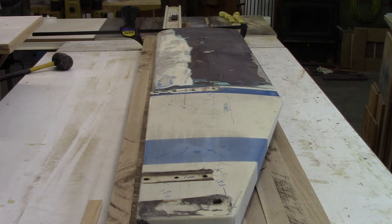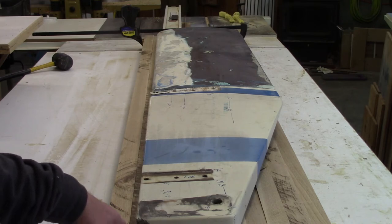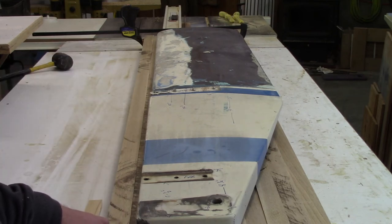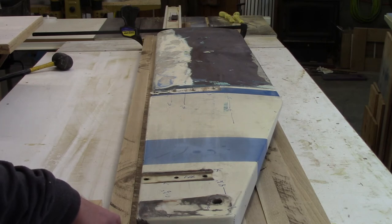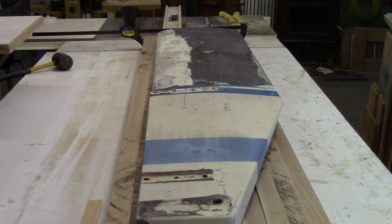While I have fairly large power tools, it would be easy to do the milling if you can get the rip cut done — either with a skill saw on a track, a track saw, or a small table saw. I think this is manageable. Planing can be done easily in a 13-inch lunchbox-type planer, which could easily handle the smaller pieces once you start milling them down. This is a manageable project for people with more normal tools than I have.